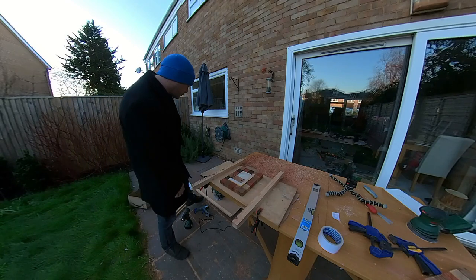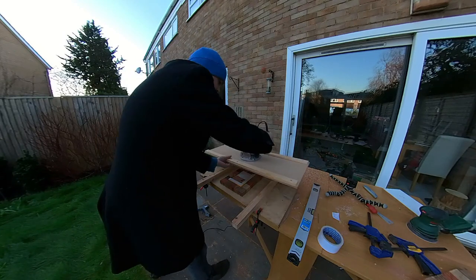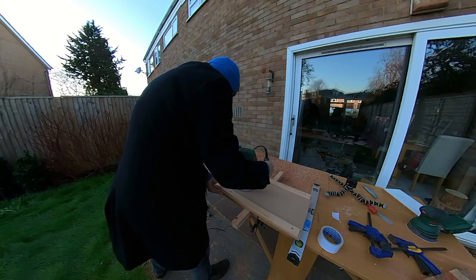If you have a better suggestion, please let me know in the comments. When you're placing the workpiece, make sure it's held securely and is absolutely flat. You'll be making this side parallel to the base of the planer jig, and so you'll want to make sure you aren't flattening it at an angle.